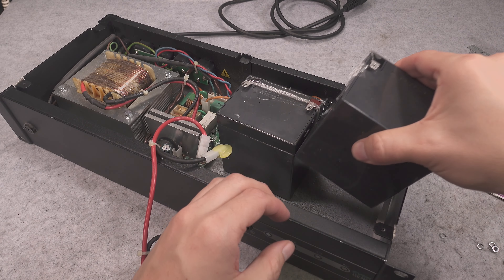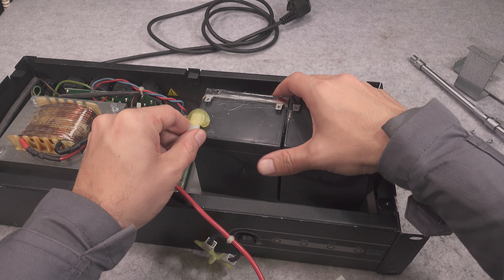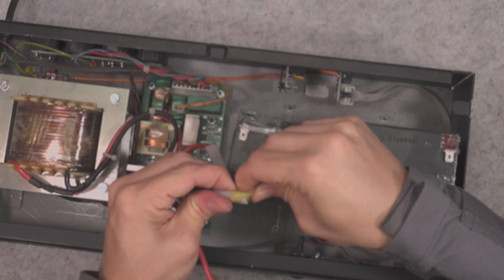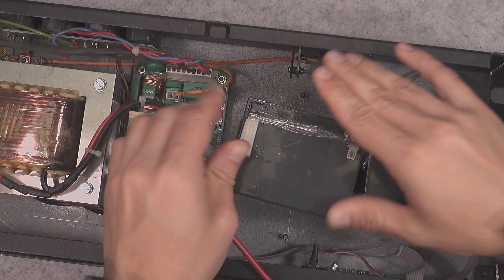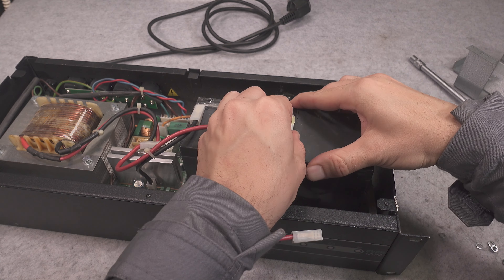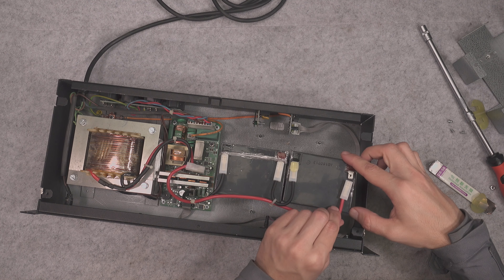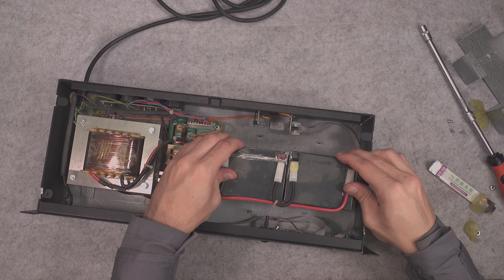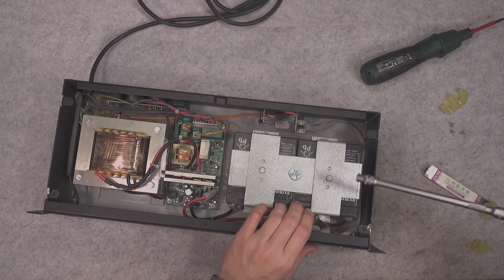It was definitely overcharged — that one is in the worst condition. Here you can see how it cracked and deformed. I've never seen anything like it. Unlike an AGM battery in a wet cell left in winter where you can have cracking from expansion, here I've seen a bulge like it melted, but never cracked. What happened here?